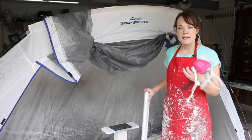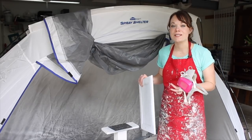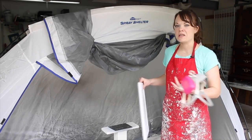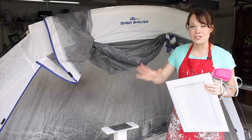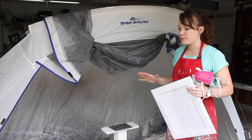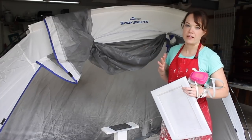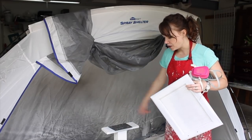We did a lot of prep work and now we've got all of our cabinets ready to spray. I think it's well worth it to invest a little bit in a paint sprayer. None of this is sponsored, but this is a great little paint sprayer for home use — whether it's your kitchen or dining room chairs. For the setup, I'm in my garage with the door open for air circulation. We set up a spray tent — you don't have to get a spray tent, you could use plastic and make yourself a box, but you want something because the overspray does get around. You definitely don't want to spray everything else in your garage, and don't want to spray your car. I also have a drop cloth down on the floor.